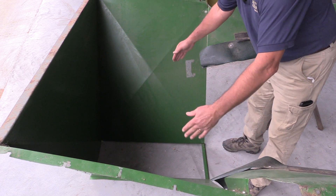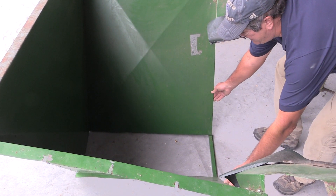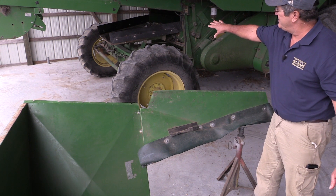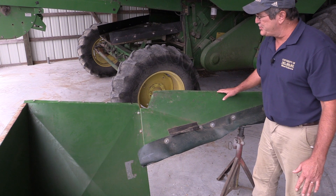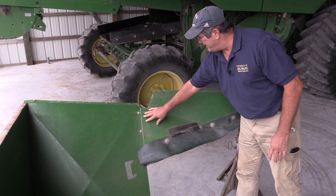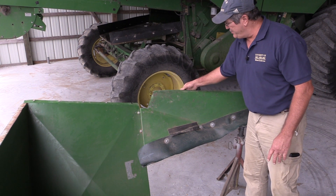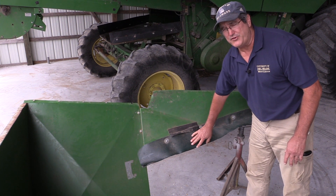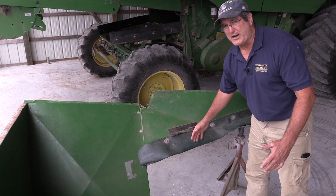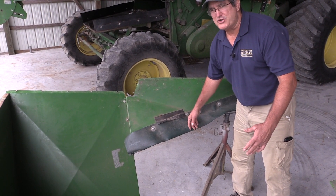The back and two sides are open at the bottom. There's a U-shaped piece of metal that helps maintain the distance and keeps it rigid at the bottom. What I call the two fins go up underneath the combine and the shaker table to help keep the wheat seeds and chaff contained. The fins had to be bent a couple of times to fit around the angle on the back of the combine. At the bottom, it's actually an old hose — something flexible that can go up inside the shaker pan to keep the wheat seeds enclosed without being attached to the moving shaker pan.